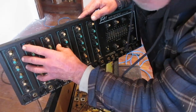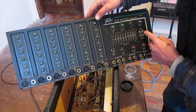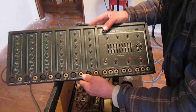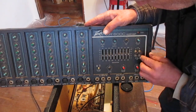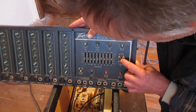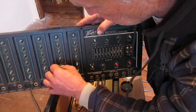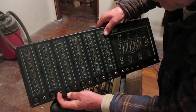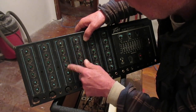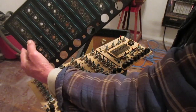To expose the PC board, all these knobs have got to come off, one by one. Got all the control knobs off. The next thing is all the little nuts and washers on the quarter-inch TRS connectors have to come off, along with the RCA jacks over here — those are for tape in and tape out. There's a small Phillips screw holding that in place, and on each one of these controls there's a small nut that has to come off as well. I took all the nuts and washers off and everything is now loose.